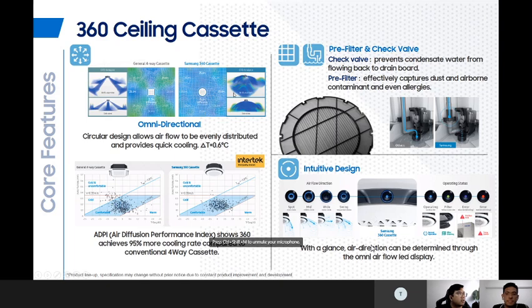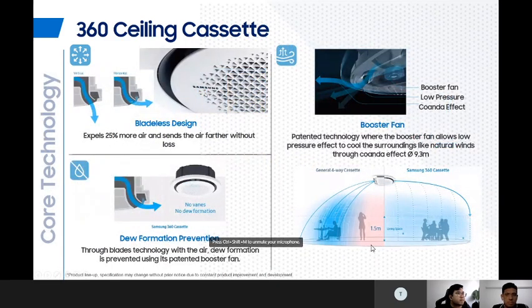You can see for 360, it is more bluish color in the room over here, right? So meaning the air distribution is much more even, okay? So better compared to 4-way cassette. And of course, pre-filter, and we have a built-in drain pump, check valve, okay? And as you can see in the video, we can cover up to 9.3 meters of diameter, right? So this will be the advantage of 360 cassette, compared to 4-way cassette,